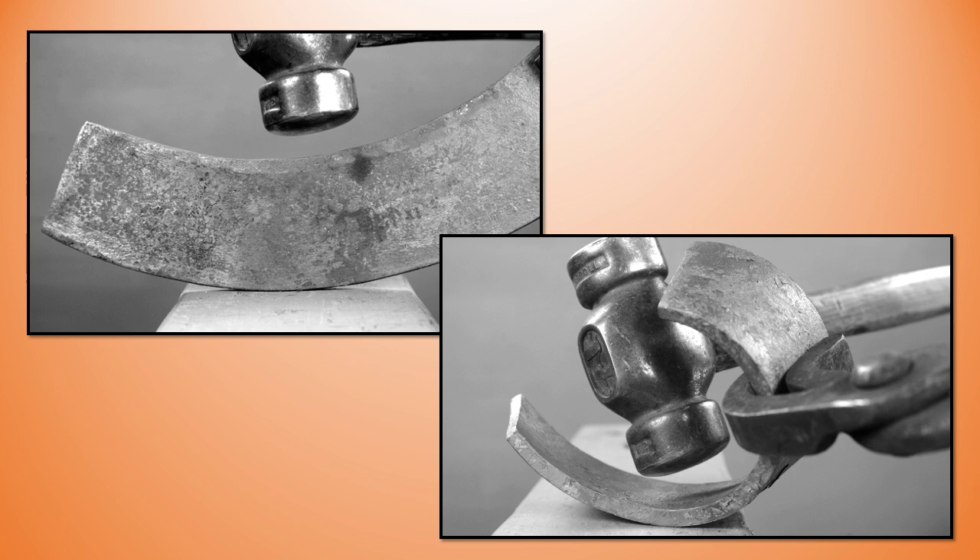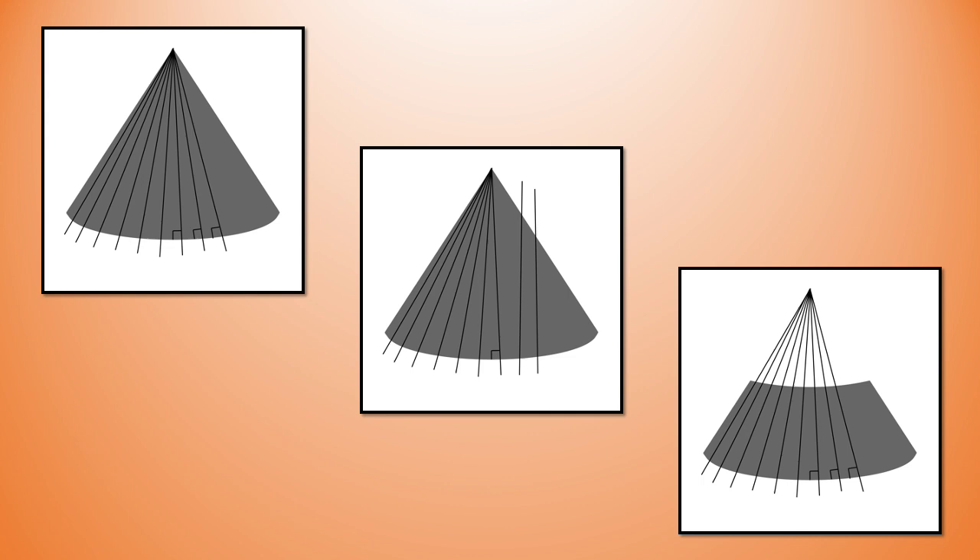The beveled scrolls are basically cones. What do we know about making a cone? First we bend it the hard way and then we bend it the easy way. If you want a tighter cone, more initial bend; if you want a relaxed cone, less initial bend. If I were making a conical hat from newspaper, I'd cut out the desired shape and roll it — bending on the line from the tip to the edge. If I bend off that line I'm not going to make a conical hat, so it's important that line is followed.